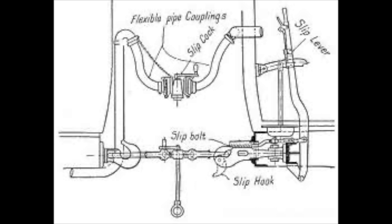It wasn't just the physical chain that had to be uncoupled. Trains were also fitted with steam and brake pipes. The steam was used to warm the coaches, while any breach in the brake pipe would automatically cause the engine's brakes to be applied. To bypass this, a slip cock was applied at each end of the pipe between the coaches. It was sealed together via a vacuum, and when the coach was separated the cock would separate and seal at both ends, ensuring the coaches stayed warm and ensuring the train's brakes did not come on automatically — which would cause the slip coach to rear-end it.